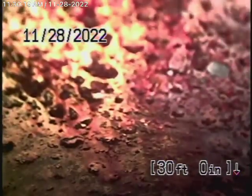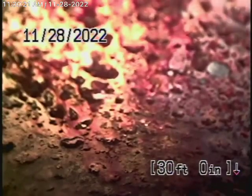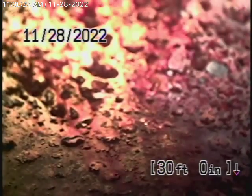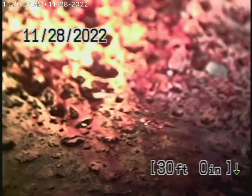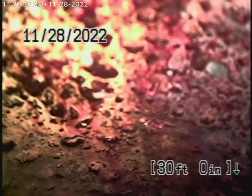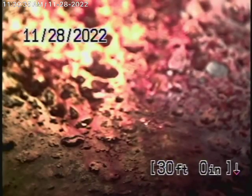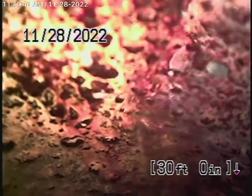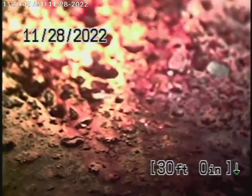What I can tell you is we've tried to run the camera from these roof vents, the cast-iron roof vents on the roof. None of them would allow us to get into the sewer line. So what we're doing is we're running our camera from this 2-inch ABS roof vent and we were able to get into the line. However, there was an incorrect fitting underneath the house that took us upstream instead of downstream.